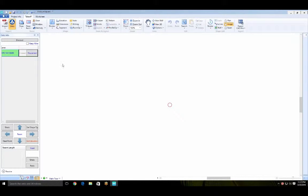Select connect, and when you get a green line that means your Disto is successfully connected. At the bottom of that screen you'll see the soft menu key with arrows going up, down, left, and right. When you're holding your Surface Pro, tap to indicate which direction the next line is going to go — for example, up — and then whatever measurement you capture with the Disto will adjust the wall drawn in that direction.